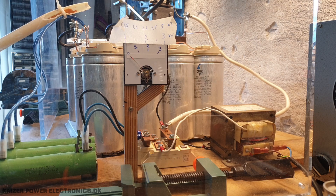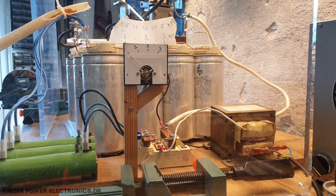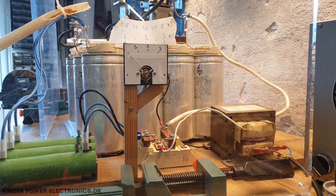I have all my protective cladding — acrylic plates all around the capacitor bank, spark gap, and explosion area. I'm going to sit behind a metal plate at the other end of the workshop, completely out of line of sight. The charger is connected. For the first test, we will go for 2.2 kilojoules, which is roughly 2 kilovolt, and then push for maximum voltage.